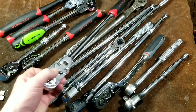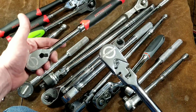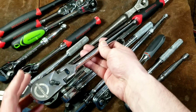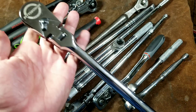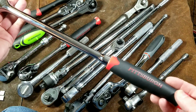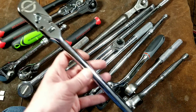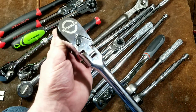And then of course we have our Harbor Freights. We have a variety of the professional ones — a standard fixed beam, standard length fixed beam, a standard length flex head, and the long handle flex head. As far as needing a nice half inch drive ratchet, I would skip all the others and just start off with the long handle flex head. The only time you think about other half inch drive ratchets is when this thing is simply too long for some situation you're working with. Otherwise you're going to like the extra torque and leverage the long handle gives, and you get the flex head at the same time. Really if you're going to have a one-off ratchet, I highly recommend one of these Pittsburghs.